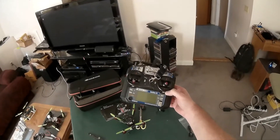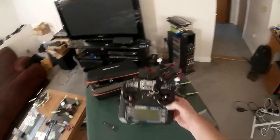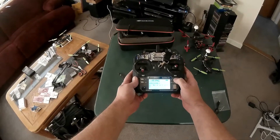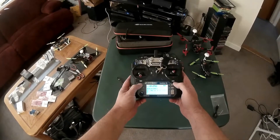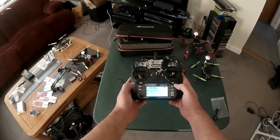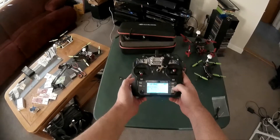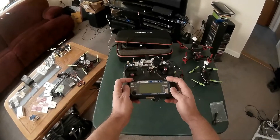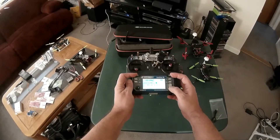What I want to show you here is: when you turn this radio on, you'll see it's locked out — you can't get into the program functions. There is an easy way to unlock that. You power it back down, press these two trim tabs in, and power it up, and the program functions are now accessible.